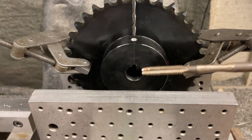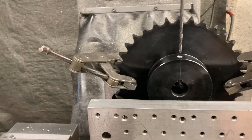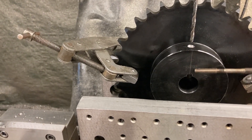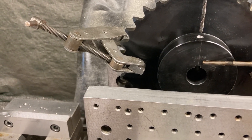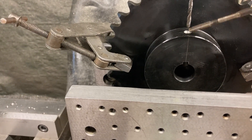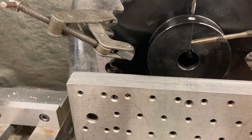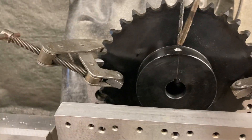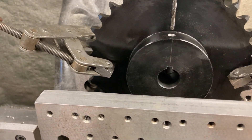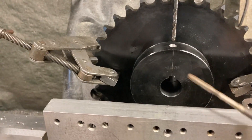I don't like four-flute taps but that's what I've got, so that's what I'm using. Before I tap this, I don't need all of that thread — that's an awful lot of material. If we've got three-eighths of an inch of thread, half an inch is way more than enough. So I'm going to take a 0.265 drill and drill clearance from here all the way down about five-eighths of an inch, just to clear out a bunch of that material so we're not tapping all the way through. We only want to tap through the bottom three-eighths to half an inch, leaving that much material in the bottom and clearing out the top.